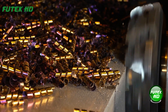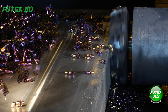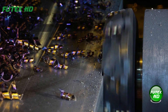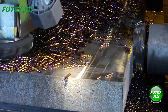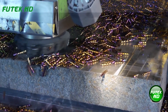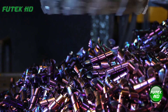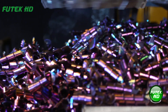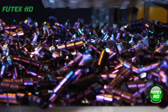These inserts are specifically designed to handle tough materials such as the high-alloy steel being machined. The cutting speed (Vc) is set at 65 meters per minute (215 SFM), and the depth of cut (ap) varies between 10 to 20 millimeters (0.4 to 0.8 inches). The feed per tooth (fz) is set at 0.51 mm/tooth (0.020 in/tooth), and the overall feed rate (Vf) is 400 millimeters per minute (15.748 in/min).